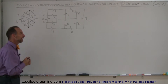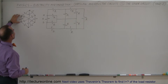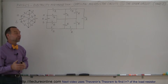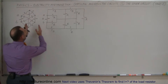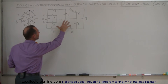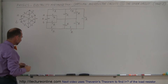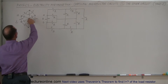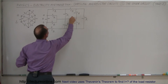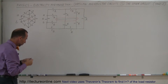So here's my second attempt at the spider circuit, where we're trying to find the total resistance between A and B of this particular spider circuit. The first thing you want to do is take the circuit and redraw it in a way where you can make more sense out of it. Notice that electrically speaking, this is the exact same circuit as this circuit, and we'll point that out in just a moment. First of all, this point where they all come together in the middle is the same as these connections right here. This here is exactly the same as that.